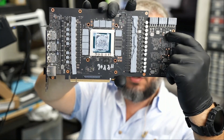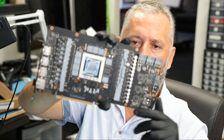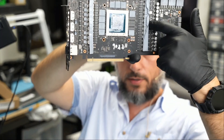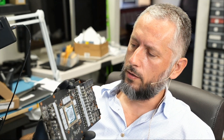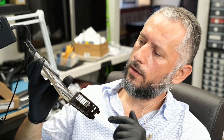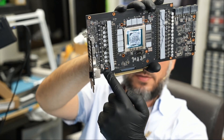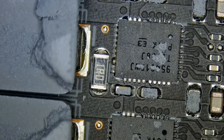The microphone batteries went dead, and I just realized we did not have audio on a big portion of the video. What I do is inject voltage at the shorted voltage rail and monitor the DR MOSFETs under a thermal camera. I've done many videos on a shorted 12-volt line and usually we see a very slight heat spot on one of the DR MOSFETs. But this time, looking closely at the thermal camera, I was not able to find even the tiniest heat spot on any of them, even after injecting more voltage. I checked both the right and left side DR MOSFETs — still no heat spots anywhere.